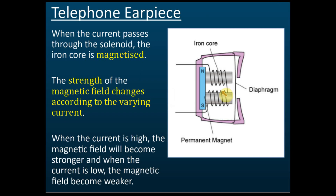When the magnetic field increases and decreases, it pulls a diaphragm made of ferromagnetic material — usually very thin iron. When the current increases, the magnetic field pulls the diaphragm; when it decreases, it lets the diaphragm go. So the diaphragm vibrates, and because the frequency of the current matches the frequency of your friend's voice, the diaphragm vibrates at the same frequency.